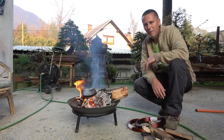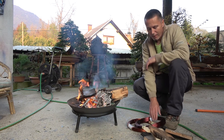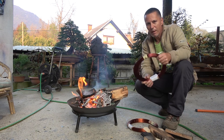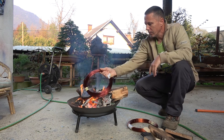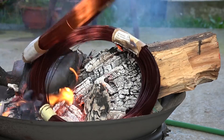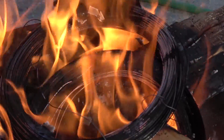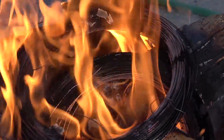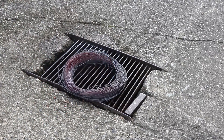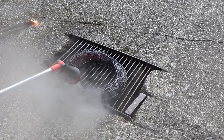I'm not trying to do some barbecue here. I'm running out of wire, so I'm buying copper wire at a local dealer for a good price, and then I throw it on the fire and wait until it becomes red. Then I shower the wire with cold water, and the wire is ready for use.